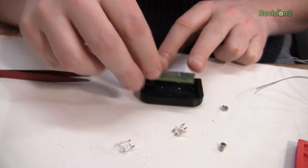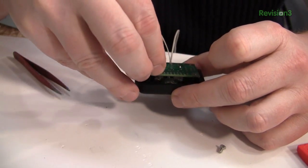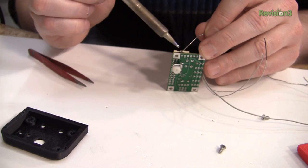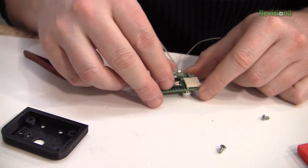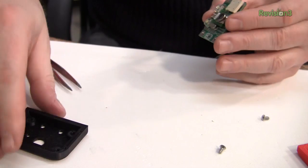My plan is to have the development board go in all in one shot, with a hole in the back for the adjustment potentiometer. I put some hot glue on there and cram it in place — that makes sure the components are attached to the driver board in the correct position for going in the case. It's a little down and dirty, but it'll work. I'll attach the piezo buzzer the same way — one pin directly to ground so it'll be fairly solid, and the other side to one of our I/O pins. The infrared sensor is nestled in between the crystal and the piezo, with the two LEDs down below.